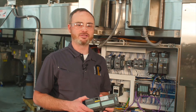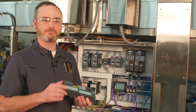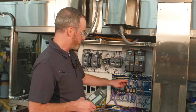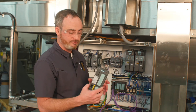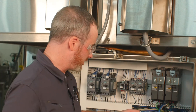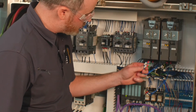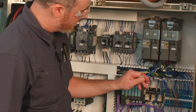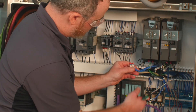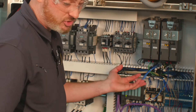Getting to the final stages of the G120 install — time to put the CU240 control unit to the front of the drive. One thing to note: the MicroMaster connection was at the bottom of the control unit, but now on the G120 it's at the top. The kit provides new wire; simply label it and run it down to the terminal blocks directly below the VFD. The 24V and 0V wires need to be removed — snip the zip tie, take from the terminals below, feed those wires up, and discard.